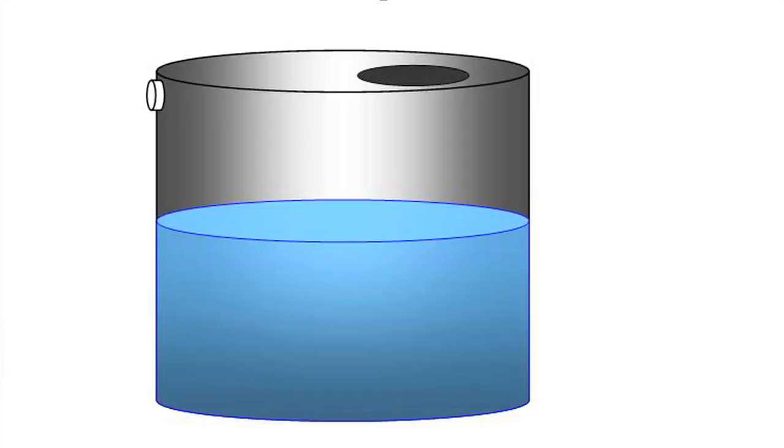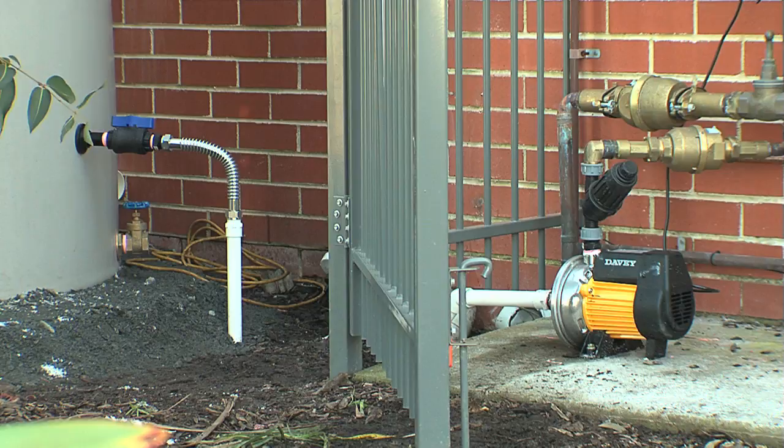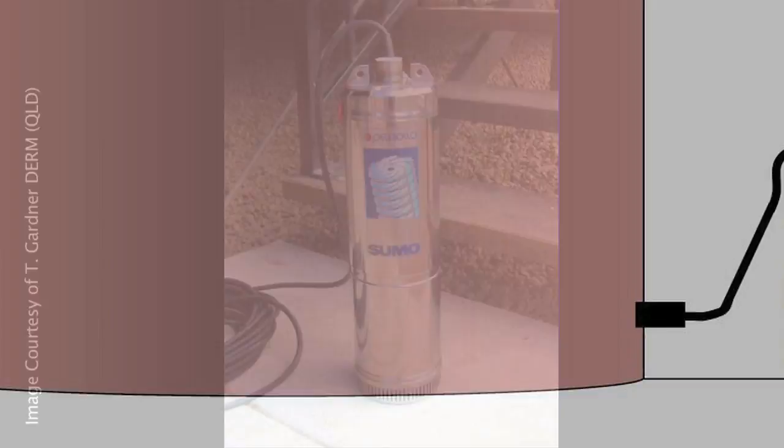The outlet to the pump should prevent the tank level from dropping below a set point. Pumps are better at pushing water than pulling it, so mount your pump as close as possible to the tank — if possible lower than the tank outlet. Submersible pumps can help achieve this. Avoid high spots on the suction line from the tank to the pump, which can cause air locks and prevent the pump operating properly.